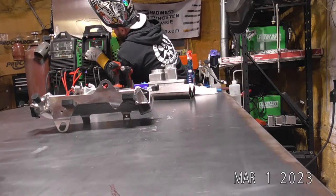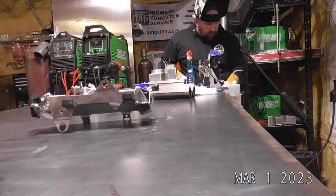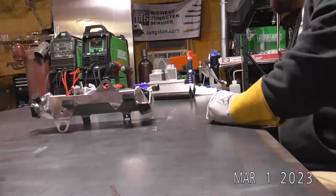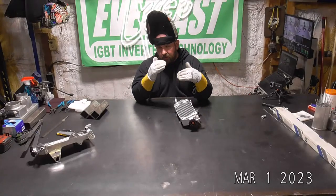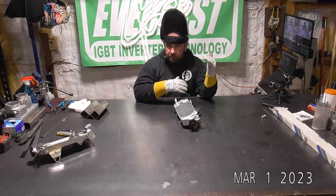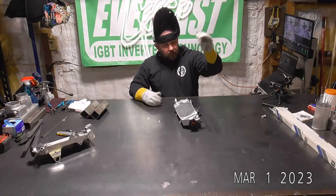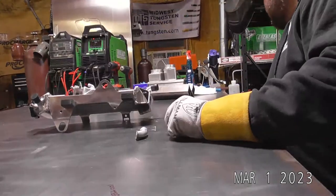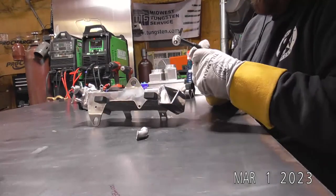I'm going to be running 81 amps on my electrode positive. Run an advanced square wave, 181 hertz and 35% balance. So I am running the same waveform EP and EN, but I am running an unbalanced EP-EN ratio. So 181 amps electrode negative, 81 amps electrode positive. We'll go into what that can do for you in probably about another 3 or 4 weeks.